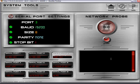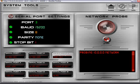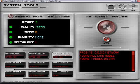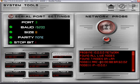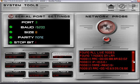On the lower right of the screen, we see the network probe tool. Let's initiate a network probe. As we can see, the ALX-G1 is actually probing our network to determine what is connected to our LAN. This is an indispensable tool for gathering all the MAC IDs on your LAN, especially if you intend to employ MAC filtering from your router. For details on MAC filtering, as well as how to configure your router, see the e-learning videos on network installation.